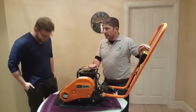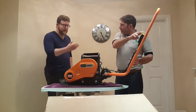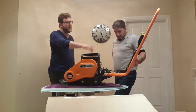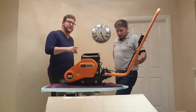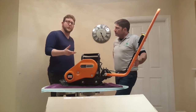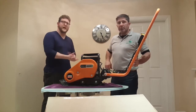Rob, the first thing I've noticed is that this is a 110V connector. That's correct. It's a 1.5KW motor with a 110V connector. That will need a 3.3KVA transformer to go with it. However, we do provide a 240V connector as well as an alternative product, so it's great for the domestic market too. So really, you've looked at safety and you've facilitated the contractor's need. Exactly, that's the whole point.